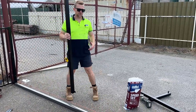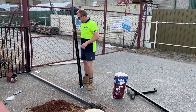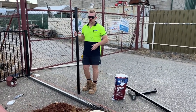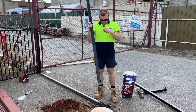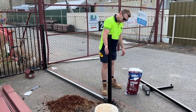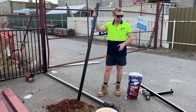I've stopped being lazy and made up a proper spacer. This spacer is exactly the length of the pool fence panel — for the black flat top pool fence panels we've got today, they're 2450mm. Always double check your panel measurements before you go crazy marking out posts and digging. I've got a mark which will go to the string line. Before putting anything in the hole, make sure the hole is deep enough — put the post in to confirm that the 1205 line sits just below the mark.